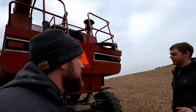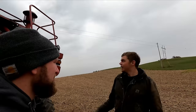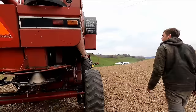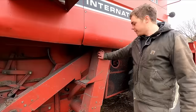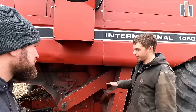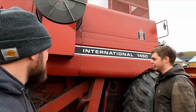That's kind of the threshing aspect of this combine. Before we jump away from that, how did you buy it? It was from an older, retired farm getting out of it. The only thing I did to get it working on the side hills were those diverters. I had a couple breakdowns last year, but nothing too major. The only common bearing issue so far was a feeder house roll bearing — otherwise I've been having really good luck. We've also got a clean grain elevator that takes grain up to the top of the tank, and a recirculating elevator under the top sieve. Any trash that doesn't make it through the lower sieve gets augered back up into the throat of the rotor to try again — it gets chewed up more, which makes it more efficient. You don't have to tighten your top sieve and you can go a little faster.